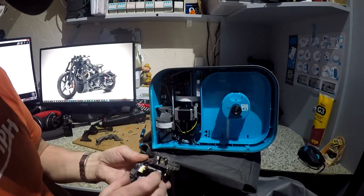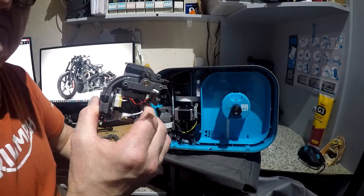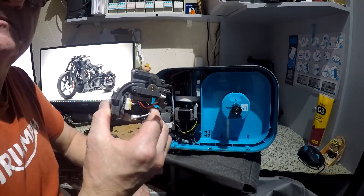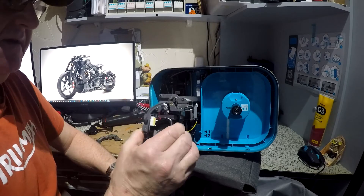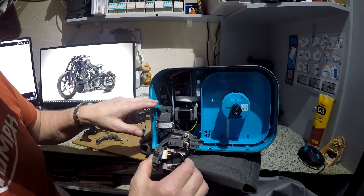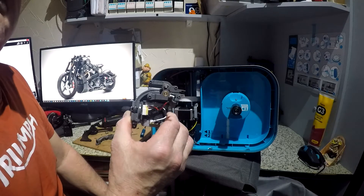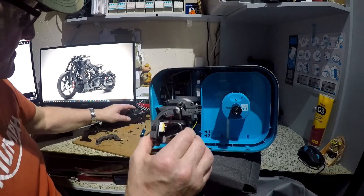It looks like I'm going to have to - as I say, this is the seventh time now. I know what I'm doing but it comes to a point where for the amount of money you pay for these - I have a Formax Pro downstairs, it's superb; I have an M200, not a problem. This from day one has done this. So now I've cleared it I've got to put it all back together, install it back in, feed the filament in. What I'm going to start doing is eject both filaments when I'm not going to use it for a while, instead of leaving them in the machine. You shouldn't have to do that, but anyway, now I'm going to put it back together.